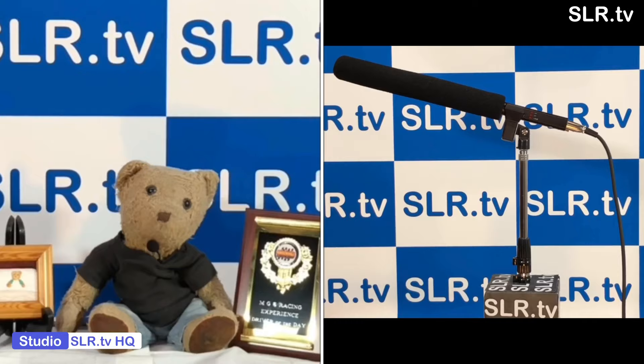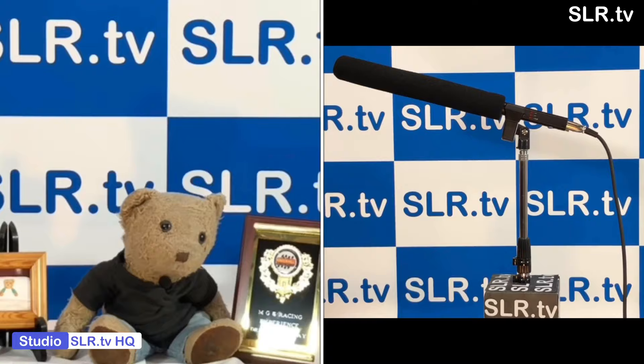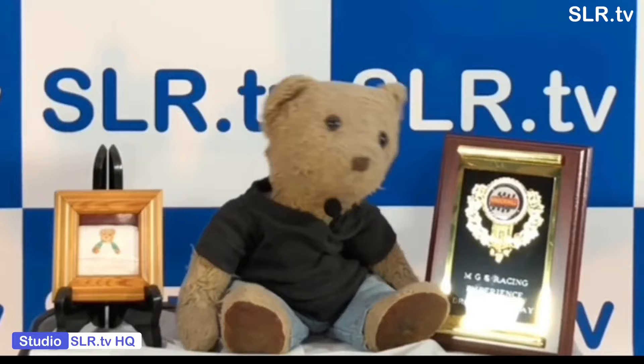The reasons we would use this one on the channel: it's broadcast quality, ideal for filmmaking or reporting. It's rugged and weatherproof. It's highly directional over the whole frequency range, and it's a three-pin XLR connection. The frequency response is between 50 and 20,000 hertz. There are three attenuator buttons for roll-off filter, treble emphasis, and there's a 10 decibel attenuator on there as well. It comes with a hefty price tag — it'll set you back between 1,400 and 1,500 pounds. But for broadcast quality, that's what we need at SLR TV. Thanks for watching and I'll see you next time on SLR TV.